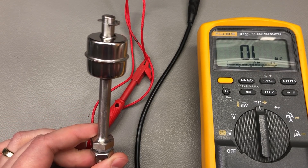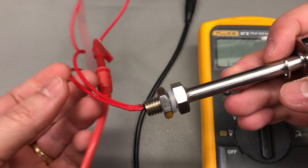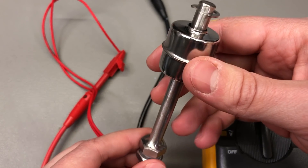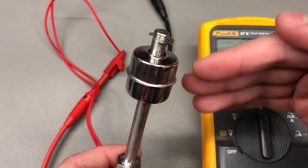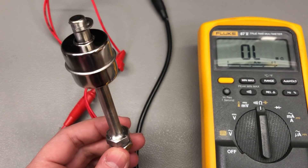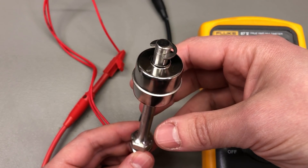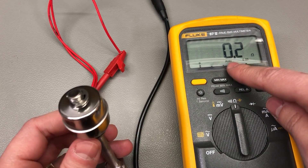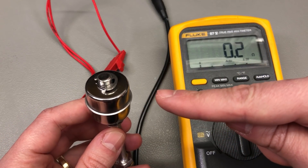The last item in today's video is this water level sensor, which appears designed for industrial applications. It has temperature-resistant glass fiber braided wires going through the sensor connection. It's an on-off floating type of switch with a moving part on the shaft that triggers the sensor connection inside. You'd install this vertically inside a tank, and when the float travels a certain distance up the shaft the switch activates — as shown here by the multimeter, it closes the switch when the float reaches the top.